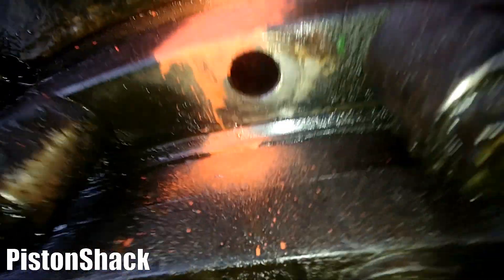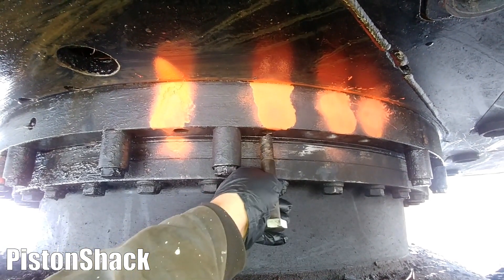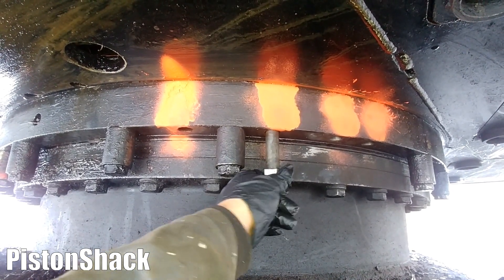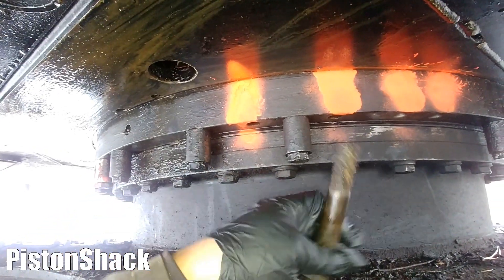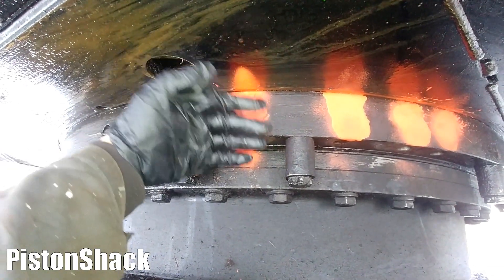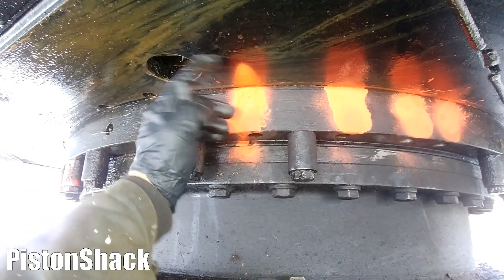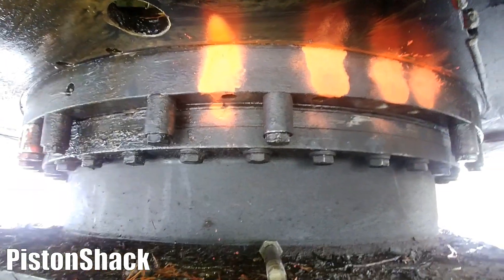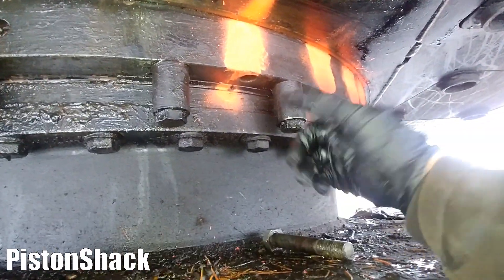That's what we have — that's our work for today. In a few minutes I'm going to show you how to extract that broken part. You can see that bolt goes like that — there's a spacer, a metal bushing, and bolts go around. If I'm correct there are 32 bolts. This is an upper bearing race, there's a bottom slewing bearing, a gear ring — the gear is inside, the pivot spins the bearing, and the house can rotate. That's our main thing, and in this video we'll focus on extracting broken bolts.